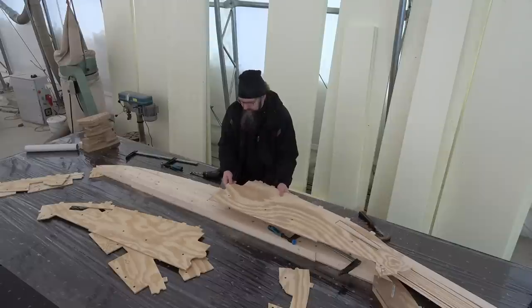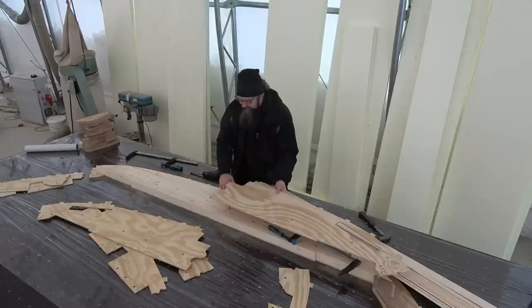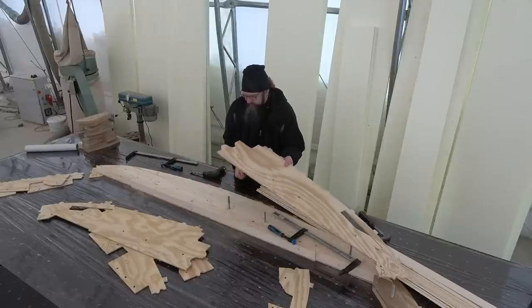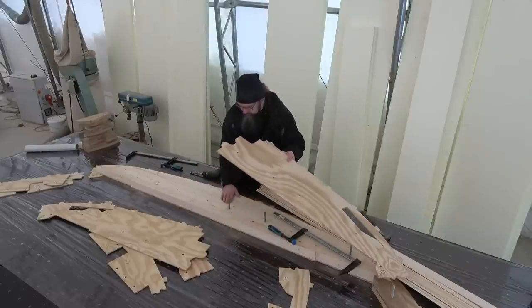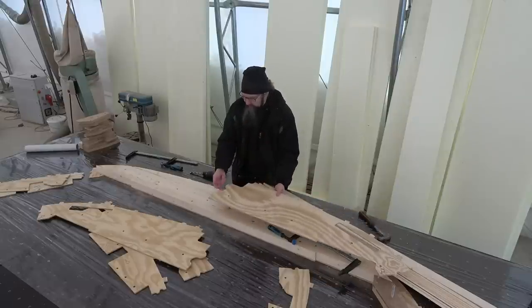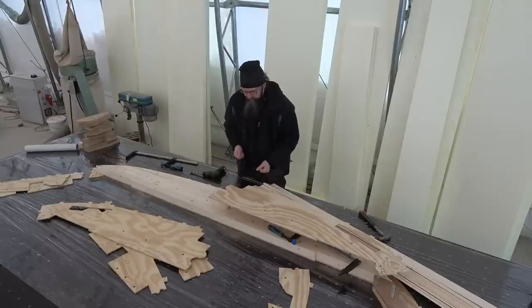So what I've been thinking now is to just put a packing tape around this seam right here and put this down temporarily, and cut this joint here and remove the tape on the other side. So when I spread the epoxy on this side, it won't go on that side. And if there's any squeeze-out coming from this seam, it will go above the tape. So I can just rip it off later.